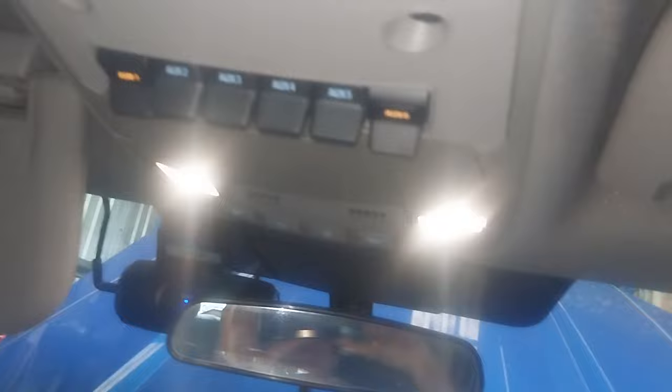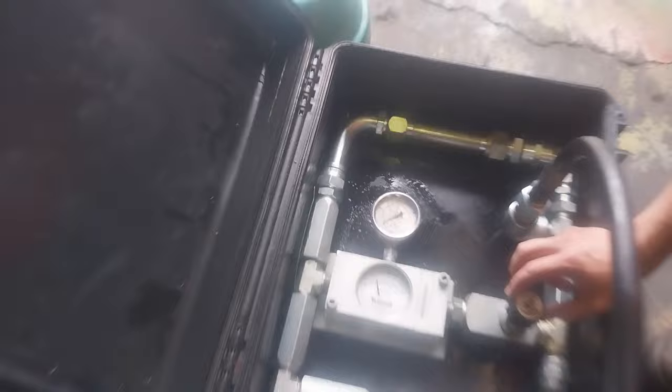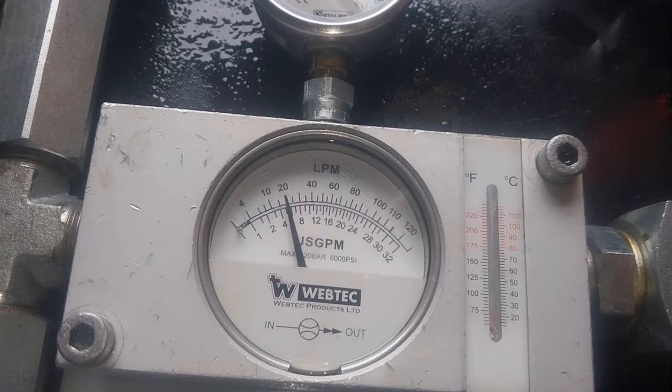The issue we have with this system is that the load hold valves are probably set too high — they've just come from the factory, probably not set there. We need to set those valves so they release before the belt starts slipping. Everything is now connected up with one hose coming from the pump through the system, through the flow check valve, through the load inducer — which is a needle flow control valve — and back into the truck. We start the engine, engage the clutch, and we've got flow registering at 20 litres per minute, about six gallons.